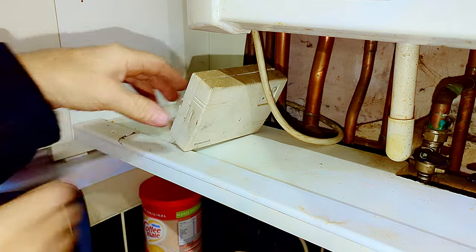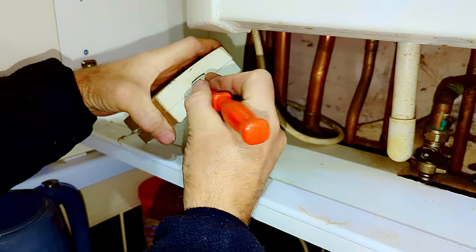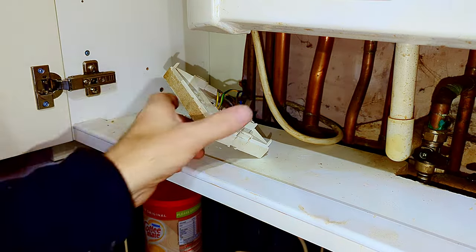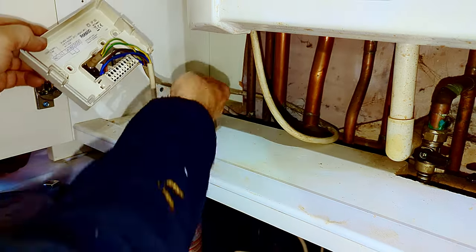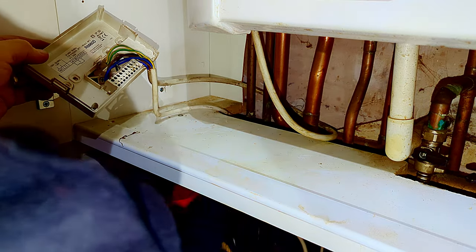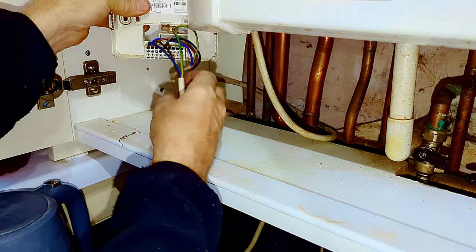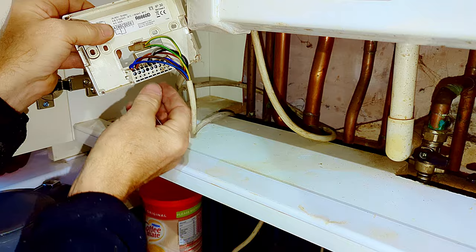The first thing I'm going to do is turn off the power — this one was just plugged in, so I've just removed the plug. Now I know there's no power on the boiler or the receiver unit. I can now take it apart. Using a small screwdriver I release the clips and take a look at the wiring on the back plate. There is a five-core flex taking the power and the thermostat switch wires up to the boiler, and also a three-core flex from the mains supplying 230 volts to the receiver unit.